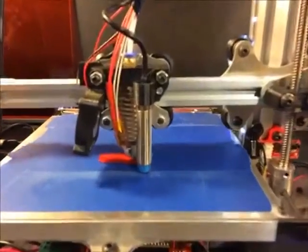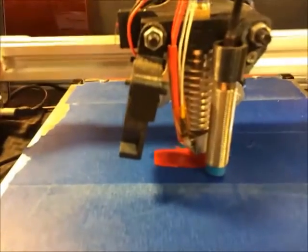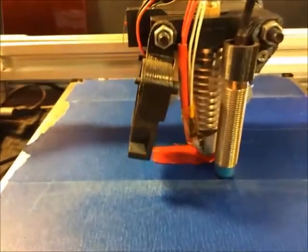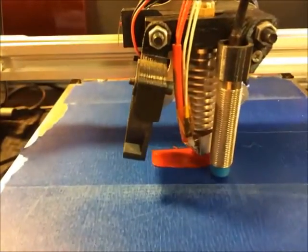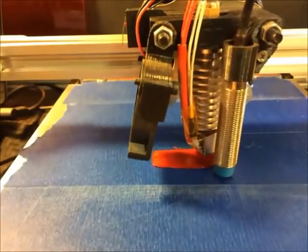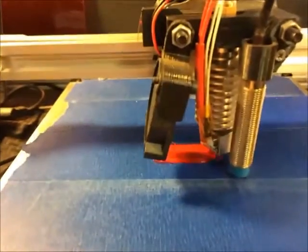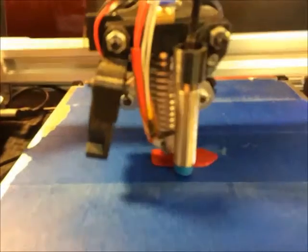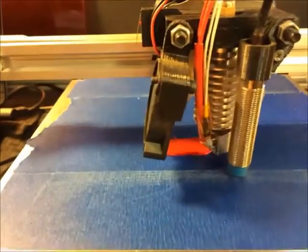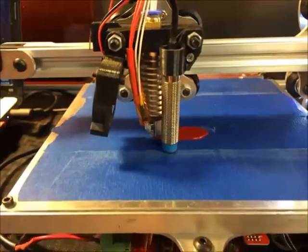Some people like PETG better because it's a little more giving than PLA. PLA is more rigid and has a tendency to crack when pressure is applied across the grain of the print. ABS is petroleum-based and will kind of bend and turn white — sort of like a Lego. If you try to pry off the edge of a Lego with needle-nose pliers, it'll give; it won't just fracture. ABS is generally considered a more robust outdoor material and waterproof. I believe PETG is also waterproof.